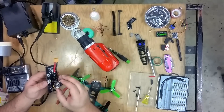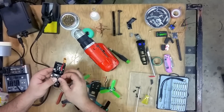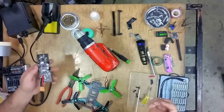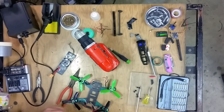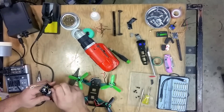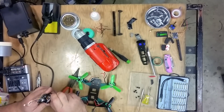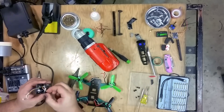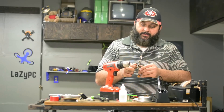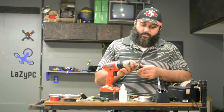As you're mounting your flight controller, pay attention to which way you face it, because I like the USB port to where I can actually reach it — but that does mean I need to go and adjust settings in the flight controller before flying, otherwise it thinks it's facing a different direction and doesn't want to fly. The nuts I'm using right here are nylon, not metal — a little better for electronics because you're not shorting out anything and you're insulating everything. However, they do not react well to being over-tightened, so I typically hand-tighten them only — you can actually strip them out with your hands.